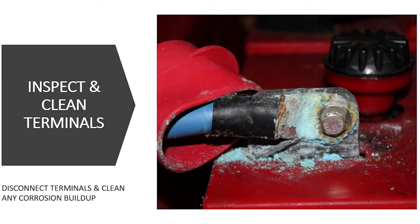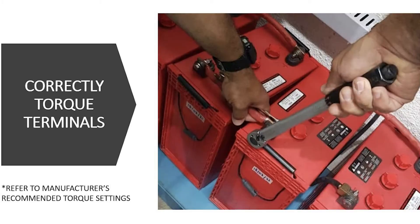Another step in the maintenance process is battery terminals. When you charge a battery, the battery terminal heats up and then cools off again. As that happens over time, the terminal connections will become a little bit loose — that is normal. So the terminals should be inspected for any corrosion buildup, then disconnected, cleaned, and reconnected and retorqued to the manufacturer's specification. We recommend doing that at least in the fall and potentially again in the spring, because if you have loose connections, those can actually arc or spark and ignite hydrogen gas. It's important to have a solid connection, as it also prevents damage to the terminals.